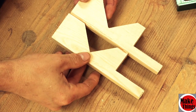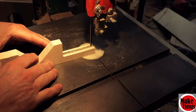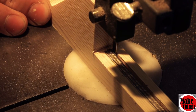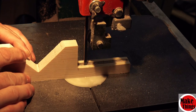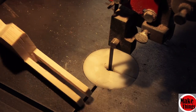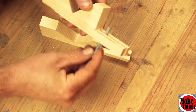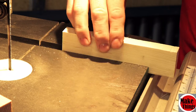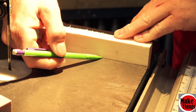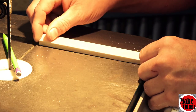This is what yours should look like after hitting the bandsaw. This should be plenty of room to get a knurled knob in to adjust the distance between the miter slot and the blade. The slot we carve out should be just large enough to fit a number 10 bolt. We'll make an expansion bar for our miter slot that allows us to lock our jig down, which is important for keeping the jig hands-free as we run material over the cradle bed. I cut mine down so that it's just slightly under the height of my miter slot.